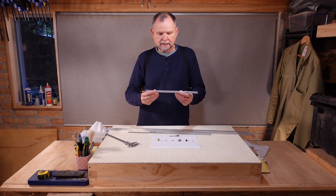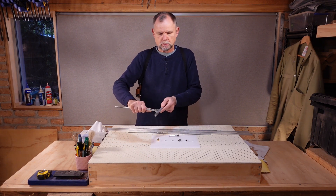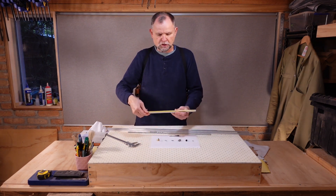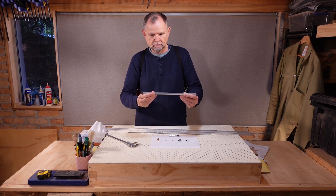This is a commercially available Martin style acoustic guitar truss rod. It's 12mm across and 10 deep. It sits flat against the bottom edge, which is sealed with masking tape. The flat edge sits up against the underside of the fretboard.